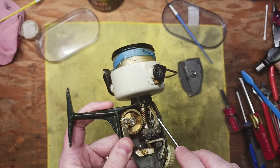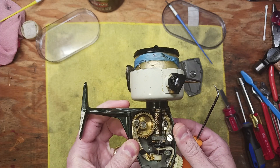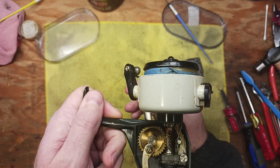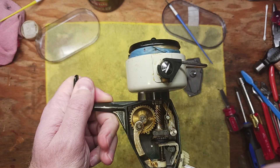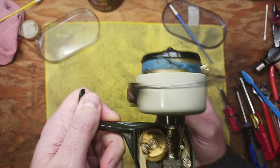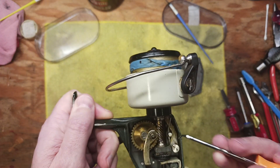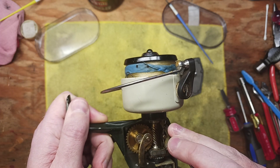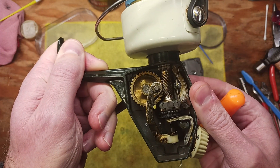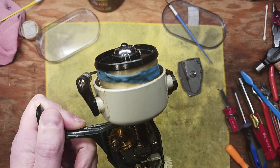The issue has to do with the spring, and we've got some really dried-up grease right here. This lever — when you move it back and forth — is supposed to engage that dog. Just fidgeting with it the tiniest little bit made it so it's actually working again. But now it's not working again, so it definitely has to do with this dried grease. Once I pull this back you can see it's moving, and you can hear it click — it's actually working.